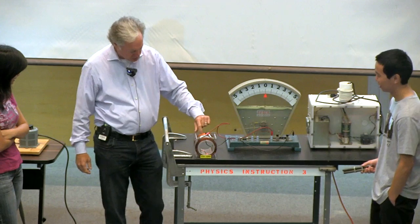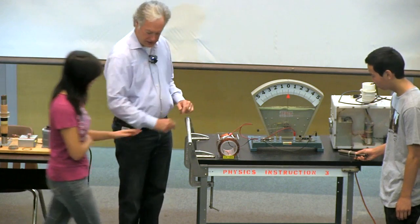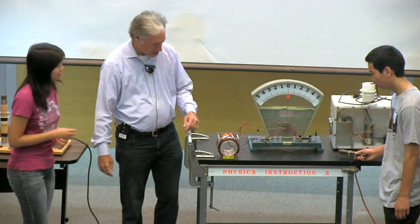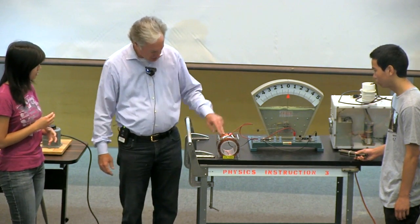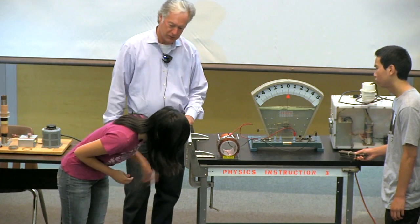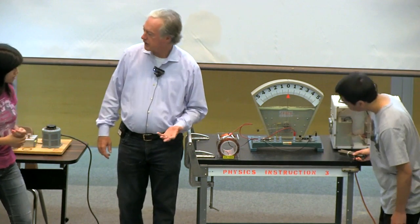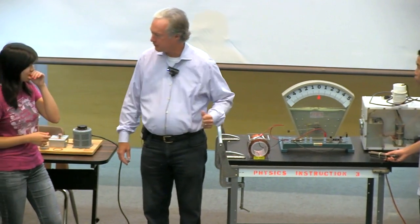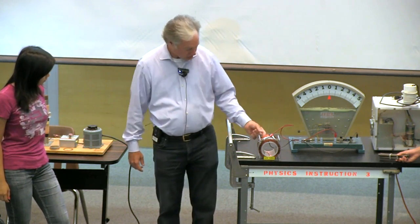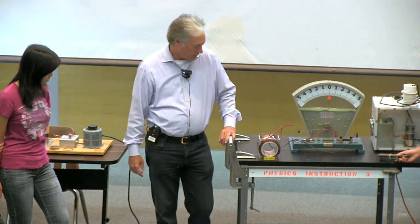Okay, so it's about 0.5 millimeter across. What's the length here? Put a finger in there and say, how many fingers across is that? It's about 10 centimeters. And how many turns are piled on top of each other? Quite a few, like 1 to 2 centimeters. So you should be able to calculate how many turns there are. You got maybe 20 to 30 turns across this way, and quite a few down this way, so you'll get up there to quite a few turns.